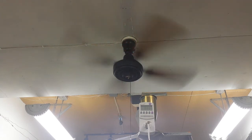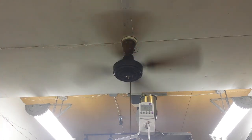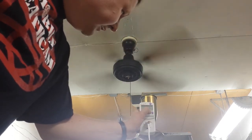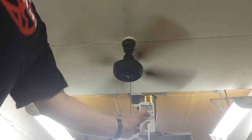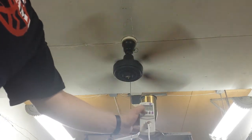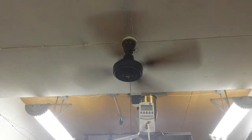I'm right at high. This is solid state high? Yes. Okay, 0.7. Let's see what the power factor is at solid state high. It was 0.88 under normal circumstances, and 0.86. Okay, so it's similar. It's about as close as you would expect it to be, given that the current draw is so close, so we already know what the wattage would be. It's going to be around about the same.